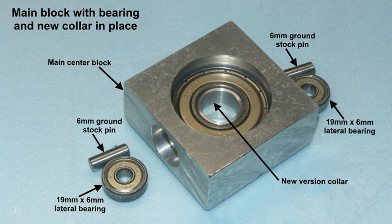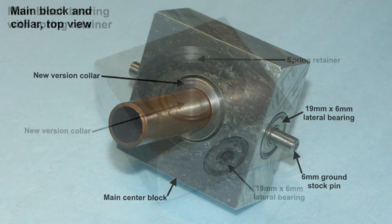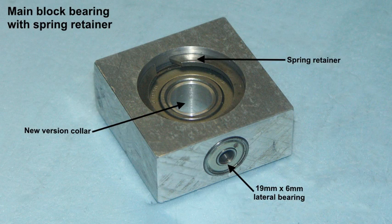Just a close-up view of the main bearing with the new collar inserted. This is basically a top view — what you can see at the top will go through the enlarged hole in the main block and protrude to bear on the slip collar, thus allowing proper rotation of the bearing. This is a more useful modification view showing the new collar coming through the main block and protruding by about a 16th or a bit more. Some means had to be found to secure the bearing in its housing in the main block, and this shows a spring retainer which was fortunately found the right size — and keeps that bearing in place.